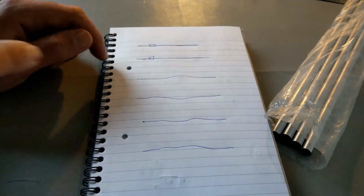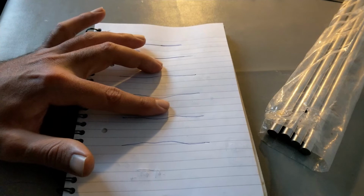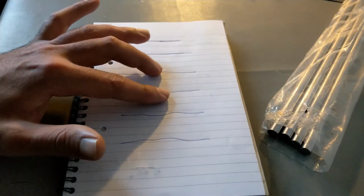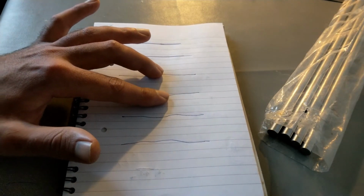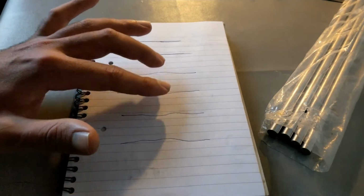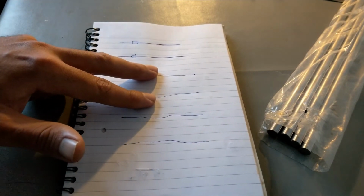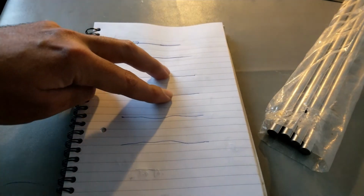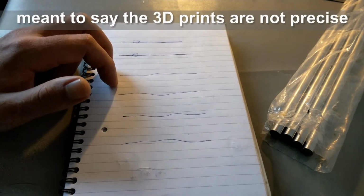What's going to happen? These bearings try to get away from each other or maybe come closer to each other, but because they are placed on a board, it doesn't happen. The bearings are stationary. So basically, when the bearing comes to these points, it gets stiff or it might jam. And this causes the 3D printer to not print well. Your 3D printed part looks ugly.